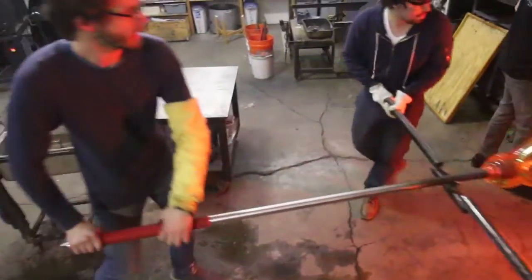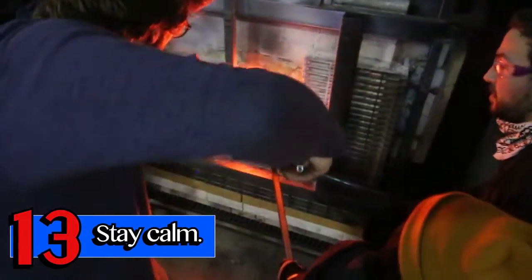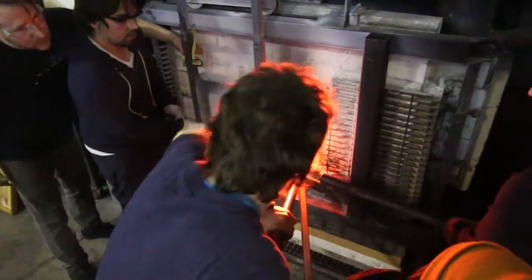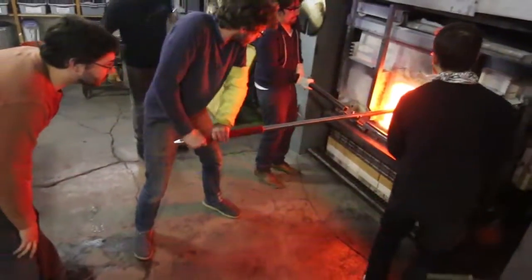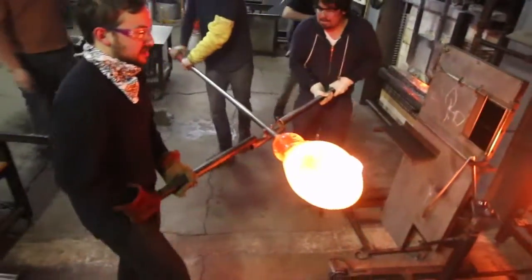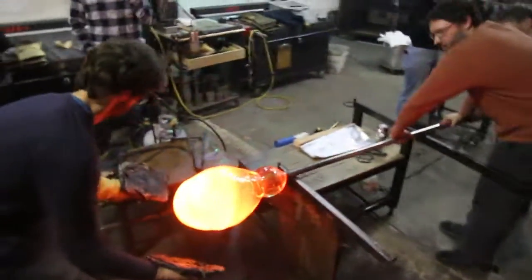Here's one more view of a final gather — I think this is coming in around 60 pounds, just the weight of the glass, not the pipe and the moil. It gives you a bird's eye view of what it's like to take a gather like this, which can be pretty intense. Just keep your cool and things will go easy. It can be very hard just to get that gather — rotating that much glass in the furnace creates so much friction that it's hard to even turn the thing, and that's an indication you're getting up to big scale. Another tip is to turn your temperature up as you get bigger and bigger gathers, and try to gather hotter so you're not losing core temperature — although that depends on what you're doing with the gather after you get it.